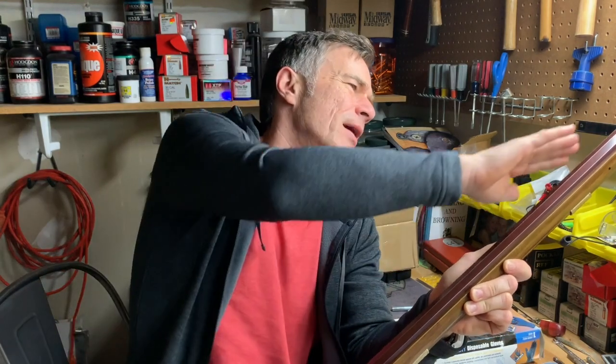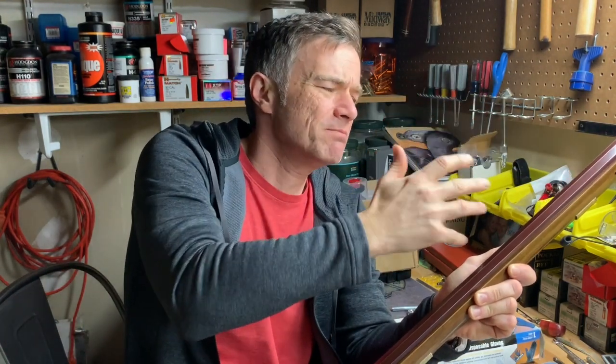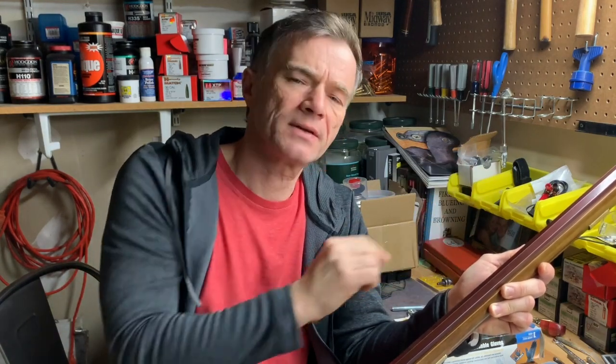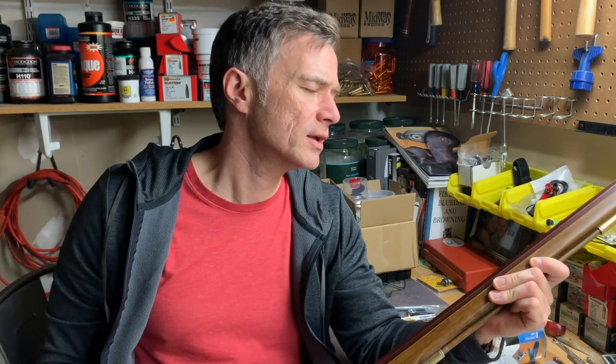I think maybe I could probably do another coat — though once it's done, it's done. I did an eight-coat process, but when you go to card it, because this is a hexagonal barrel, you have the edges and you end up removing a little bit of the rusting off the corners of the edges of the barrel. When the light hits it, it looks like there's a very thin coat there.